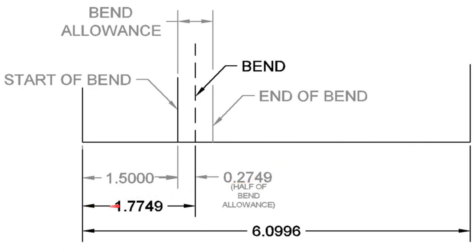The location of the first bend comes from the blank calculation. On some prints you'll see the start and end of the bend indicated, though it's more common just to locate where the bend happens. If your supplier is going to be doing the bending, it's best to give them a print of the finished part and let them do the bend allowance calculation. However, if you're the person doing it, you need to know how to calculate it. There's also a nice PDF available online for calculating bend allowance.